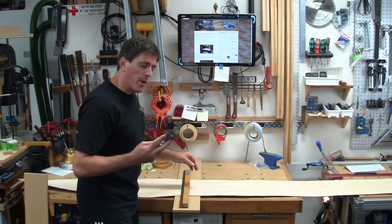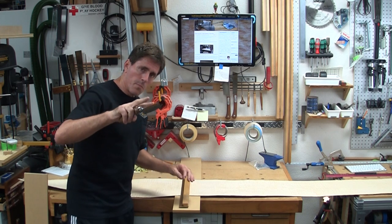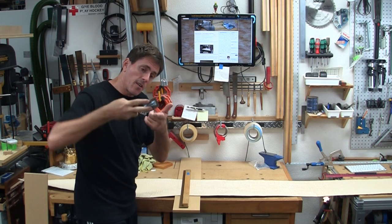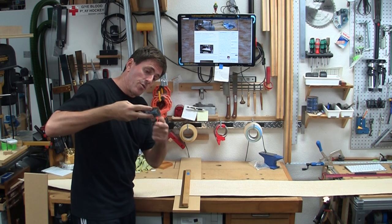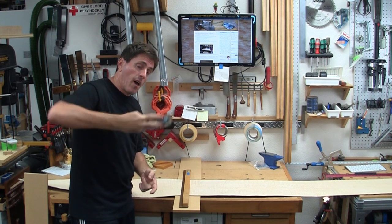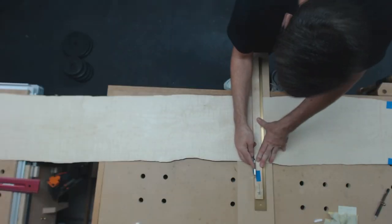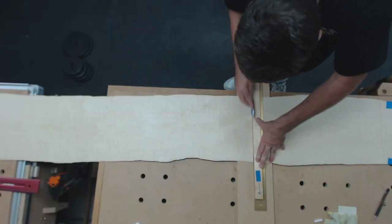So one of the things that he pointed out is that when you're doing it, press the saw up against the side of this edge, and you're not going to want to keep it just straight and cut, or else you're only cutting with this middle part. You're going to want to kind of roll it. So it's just a gentle roll, but it'll actually make for a very nice cut. Go a couple light passes at first to score it.